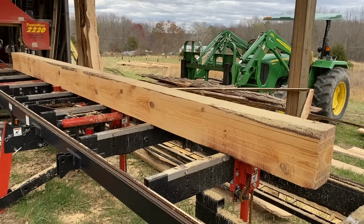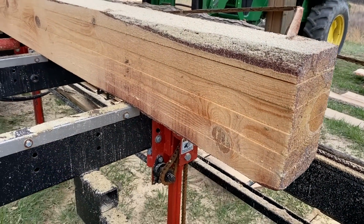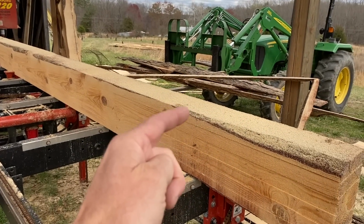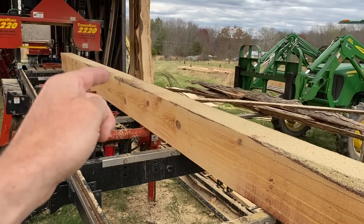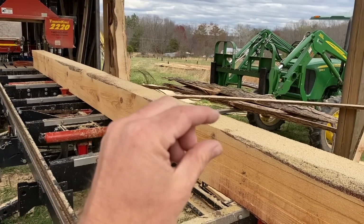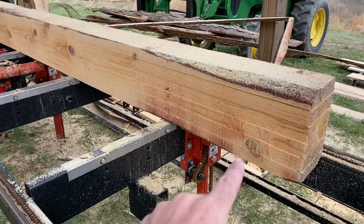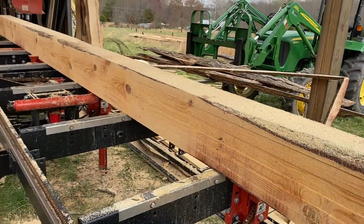Last thing to do is get these stacked up. Before we do that, I got 5 full size, and then the bottom one is 1¾". All I need is 18 feet, which is coming to somewhere around right in here. So this portion here with bark makes no difference, and right down there, it makes no difference strength-wise. Keep in mind, these are 2 inches thick, not 1½ like store-bought. The bottom one at 1¾", I think of that as skinny, but still, again, thicker than store-bought.